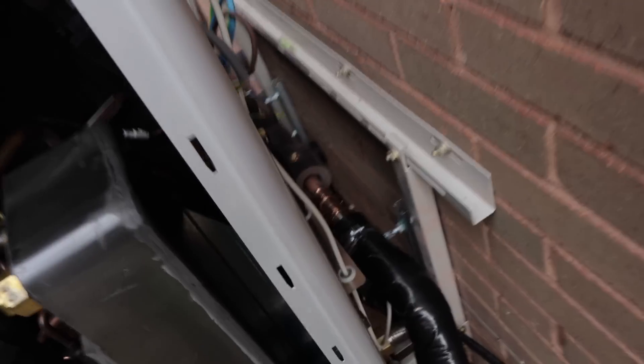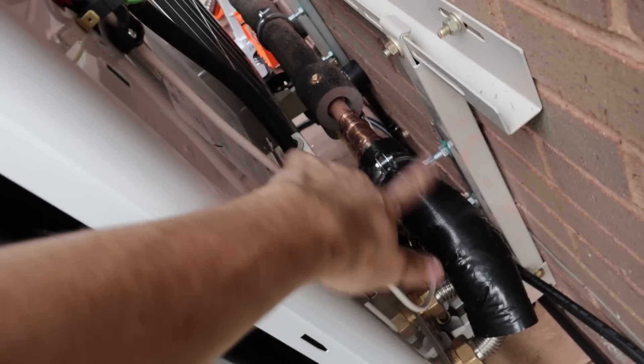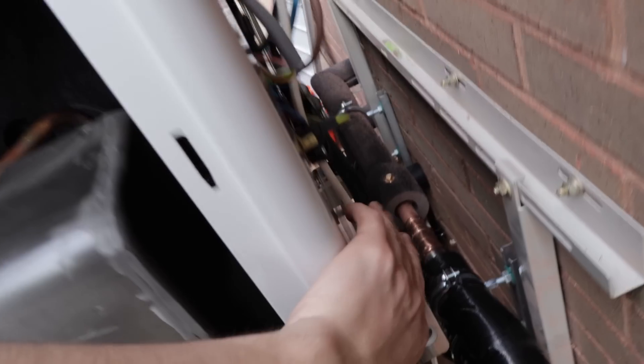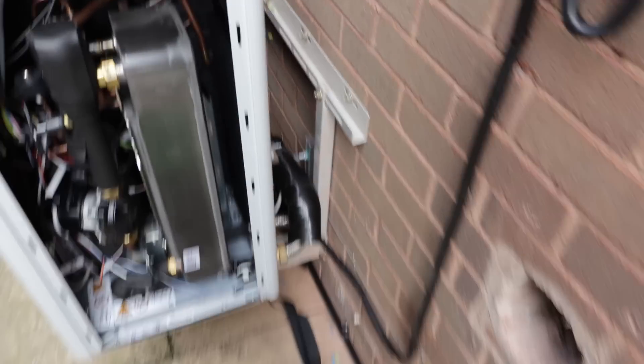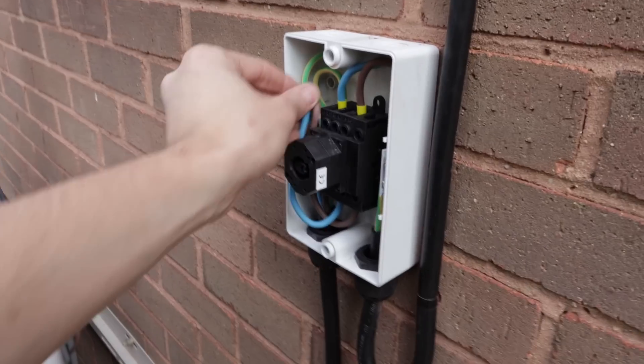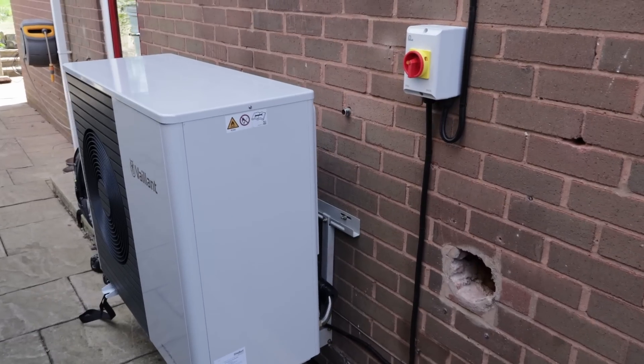That's all wired up — I had to use the Choc-Plus set to get in where the connections were. The bus cable is coming up here, this cover needs to go back on, and I need to cable tie all the slack. I've left enough slack so you could pull it off and set it down if needed. The power cable from the isolator is going in there with little loops so it'll be pushed back and contained with the cover. They're cable-gripped through the manufacturer grommets and will be cable-tied all the way down. Everything's ferruled, nice and neat.